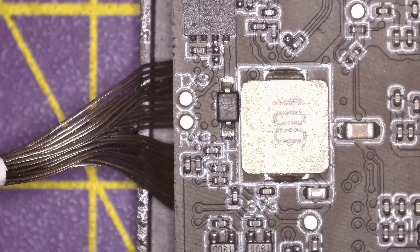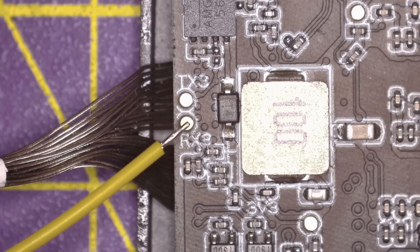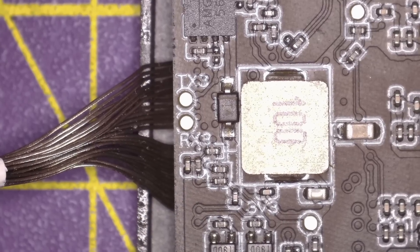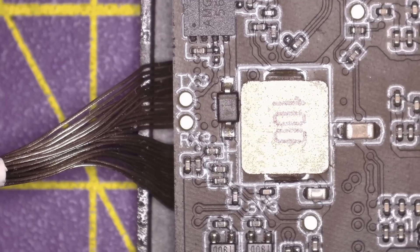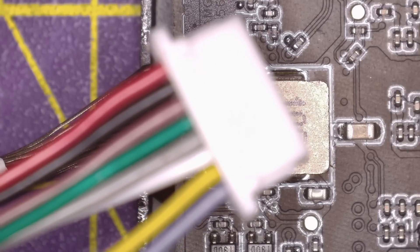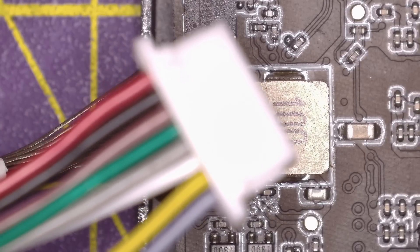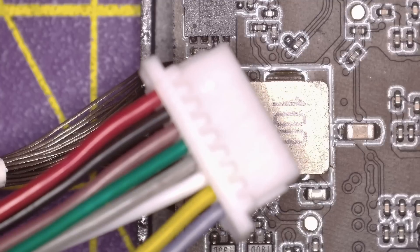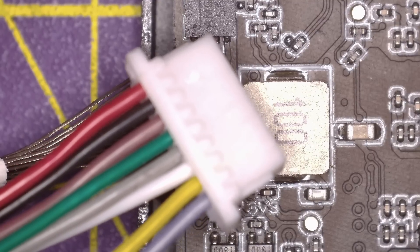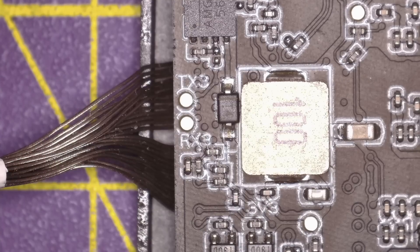These are tiny pads. Just to show you, one of the pre-tinned wires that comes with it is already a little too long, so it'll need to be trimmed before soldering. Regarding the pinout, Caddx does show it in the gimbal manual. On this little connector you can see red, black, brown, and green — in that order. Brown is RX, which goes to TX on the gimbal, and green is TX on the gimbal, which goes to RX on the board. If you get them the wrong way around it's not a major issue — you can swap them in the connector. So brown goes to the top pad (TX3) and green goes to the bottom pad (RX3).